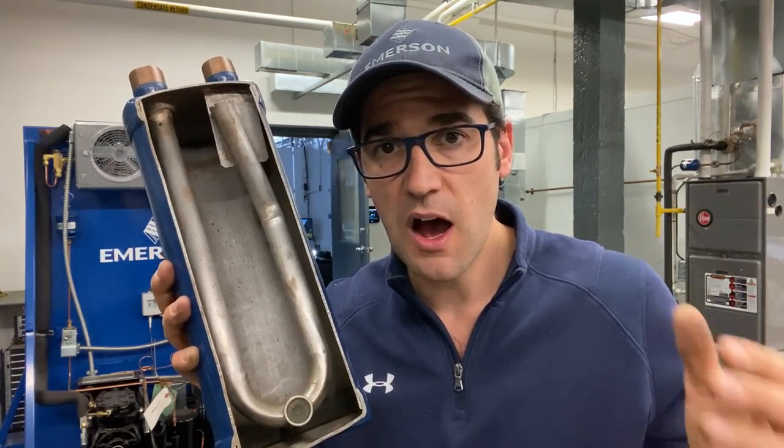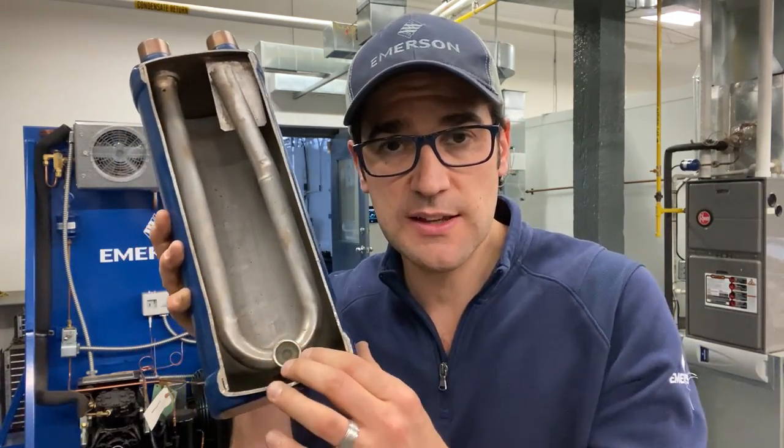This happened to me before, and this is why I want to let everyone know. I replaced a compressor and did a great installation — I purged, did a great evacuation, set the system up perfectly, got it running. Three months later, my boss called me to go back and check the site. I got back and had a seized compressor. Why? Because I didn't change that accumulator. I didn't know there was a screen in the accumulator that could plug up and cause oil not to make its way back into the compressor. So be aware of that.